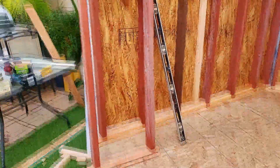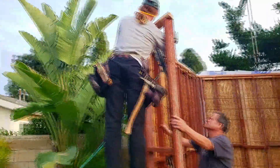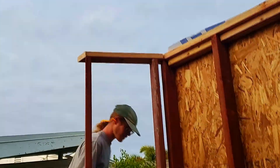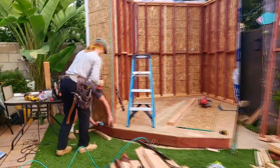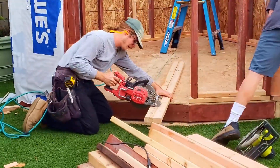I was delighted that walls were put up and flooring was laid. By the way, you would never want to build this right onto a slab structure — you always want to have a subfloor because of moisture and future potential problems. That's another reason to hire someone who really knows what they're doing. Christian was up and down and all around, hammering and sawing and scrambling and measuring. This guy worked so hard. Another element that had to be accounted for was that it was not a perfect square — my husband's idea to make it fun and whimsical. That equates to nothing being even or standard, so everything has to be measured and remeasured and fit together.